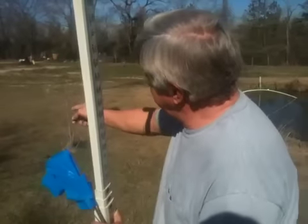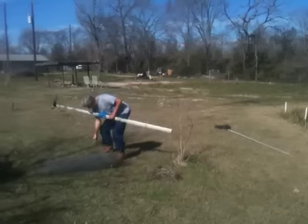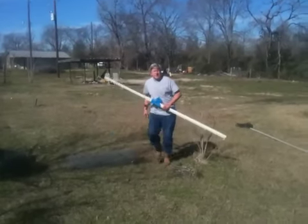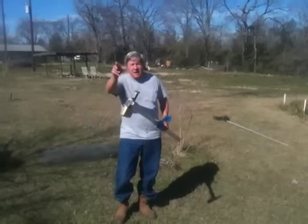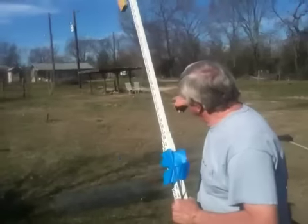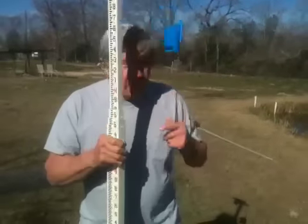But normally this would just be moved up so that you'd have a fairly straight line — something like that. You're gonna correct every 50 to 100 feet. You're not gonna get little tiny curves in there. You're going to smooth out your contours so that they come along pretty much like that. Especially on 30 acres. So now you can see that I can continue this process all the way. I can go 800 to 1,000 feet over there following these contours.